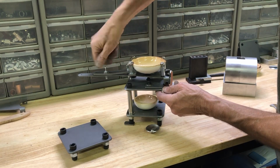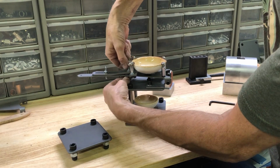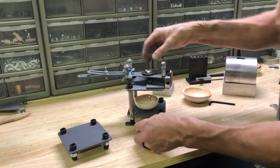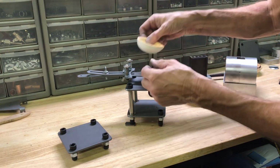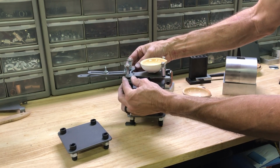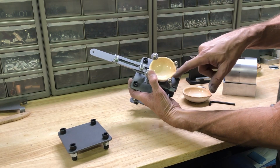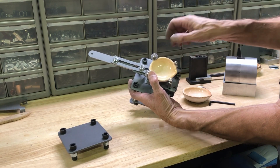The other thing is you loosen these. That gets slid back, and you can take this out, and then if you wanted to, you can put in this support disc, which works with a smaller crucible. And then what you'd do is you'd raise this up and set those down. But you want to make very sure that these bolts, the tops, fit over the edge of the crucible.